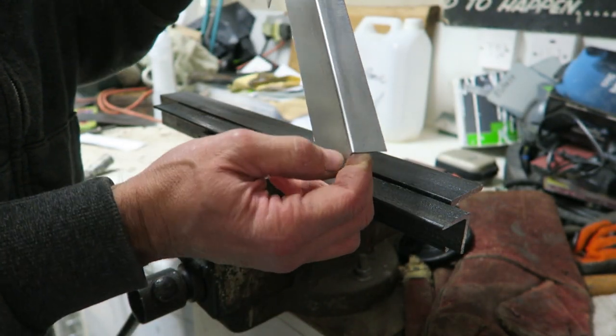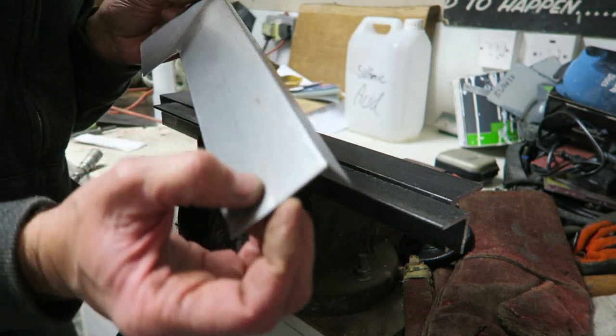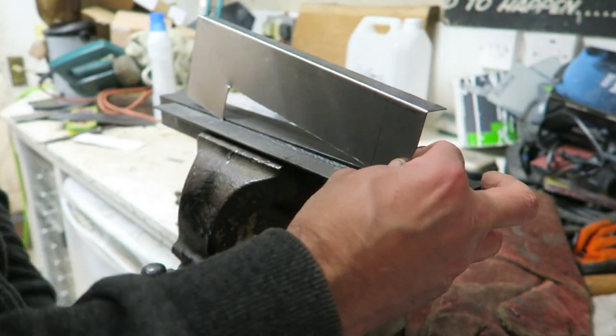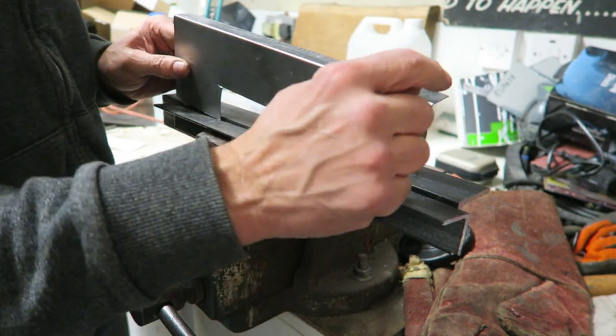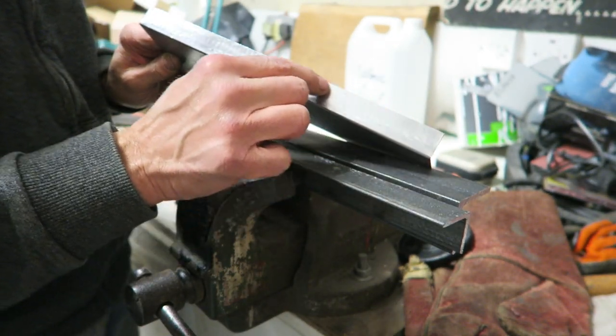Very nice, sharp, right angle bend. Everything really straight. If you're going to use this, what I would do, or I wouldn't do rather, is when you use it, I just keep easing it over, but I wouldn't dress the outer edge that hard.